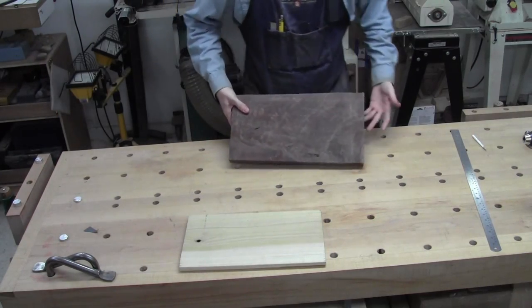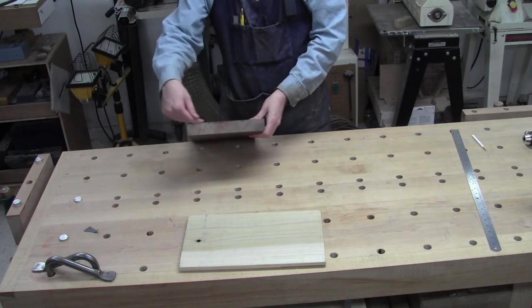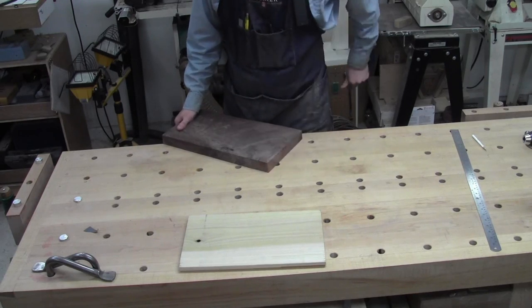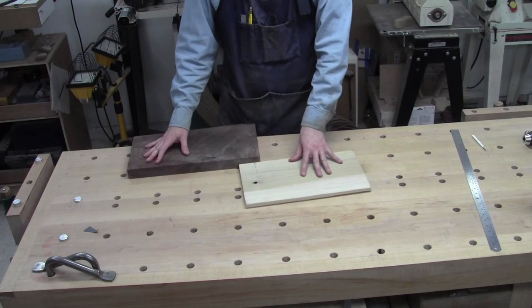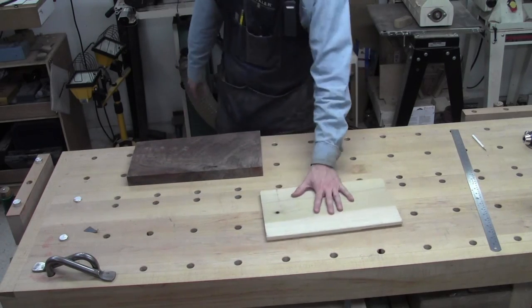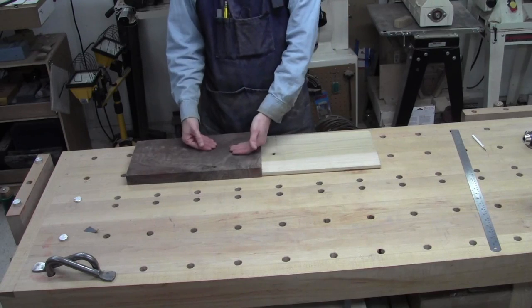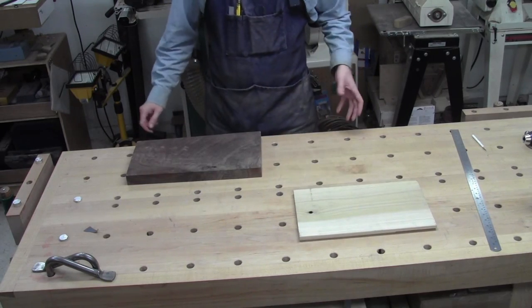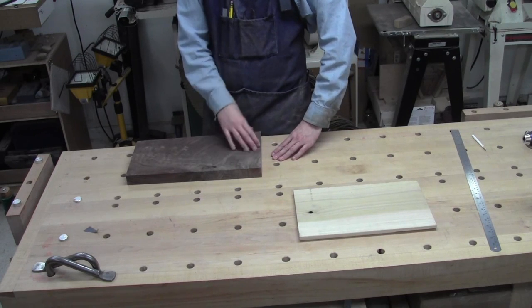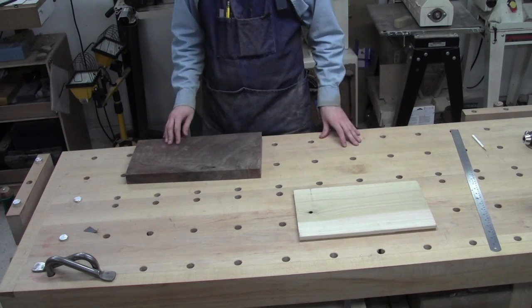Okay, so the joinery I've chosen: I'm going to cut a big old wide slot in the end of this, right in the center, a nice half inch thick slot. And I'll get it as deep as I can get it on the router table. And then I will fill it with a strip of poplar as deep as I can. I'm basically going to make a big, long, fat spline that's going to go in there. The idea is the grain direction on this board and this are the same, they both run together, so I don't have a cross grain situation, so I can glue the whole piece in as deep as possible to keep it fairly structurally sound. The idea there is it's not going to be the only thing that keeps the table spanning strong. There's going to be a big support right in the center so that it'll hold that seam from cracking, hopefully, and a support on either end, probably, or near the ends. So that's the plan.